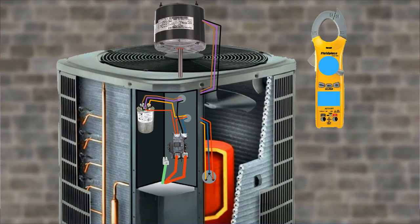You only have so much time to do this before the compressor shuts down, but next I usually take a stick or something and try spinning the fan blade with it. If the fan blade starts spinning after giving it a little nudge, I'd check the capacitor next.